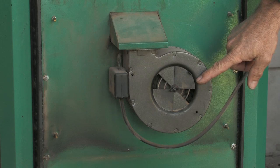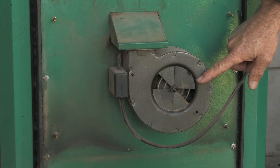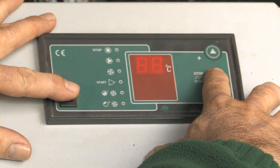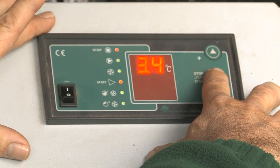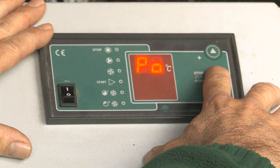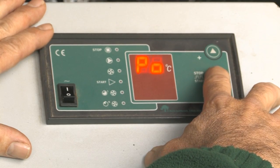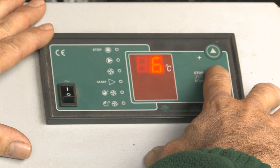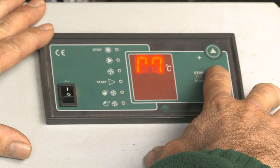The shroud will take in air when the fan operates, and ideally the fan should be 50% open as is set here. Finally, to aid pyrolysis it is ideal to set the fan modulation at 60%. This can be done by turning on and holding the red button down and scrolling through the hysteresis setting, the pump operating setting, the temperature differential setting, and then you will come to the fan modulation. You can see on this Angus Super 40 it is set at 60% for optimum pyrolysis.